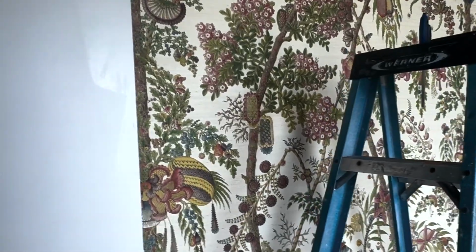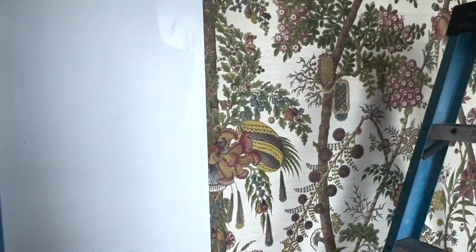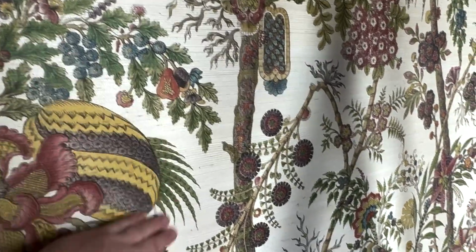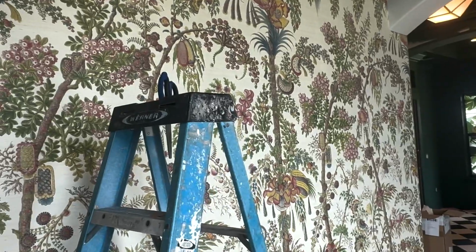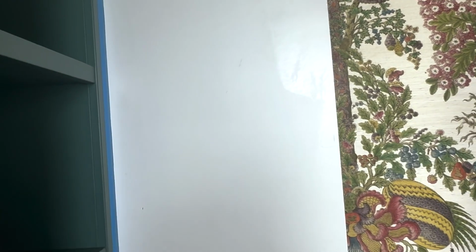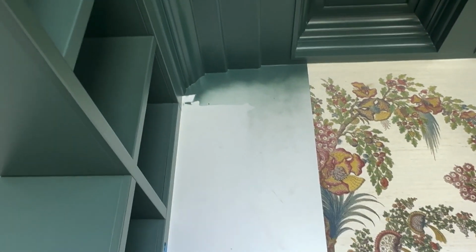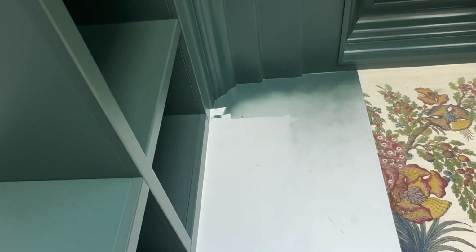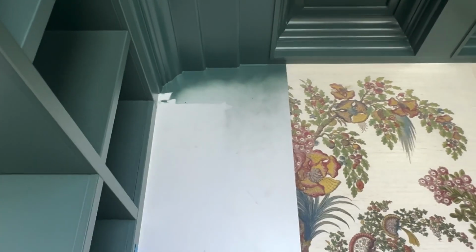First of all, we need a drier paste because it's Grasscloth. If you use a moist paste, no doubt the moisture will come through and darken this pattern, and you'll keep your fingers crossed hoping that there won't be a stain when you're done. Having said that, you're going to use a drier paste. 2, you're going to need scissors, and I'm going to show you the technique when we get there. The folks in the UK have a very nice way to handle this. They use a pencil. I'll incorporate both if I remember the pencil. I like it a lot.